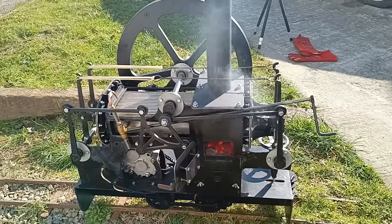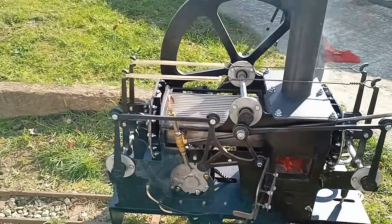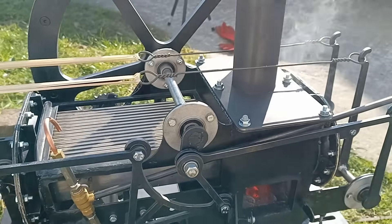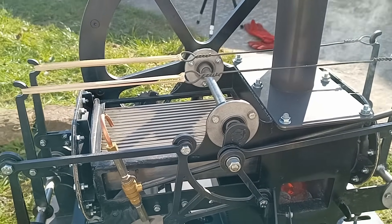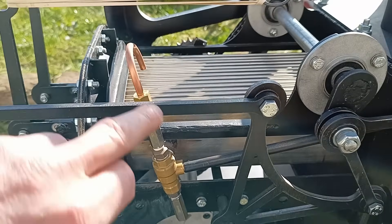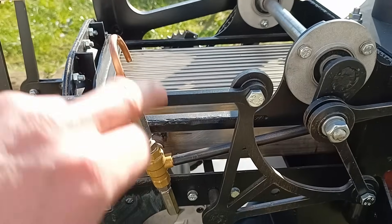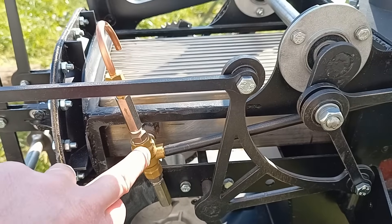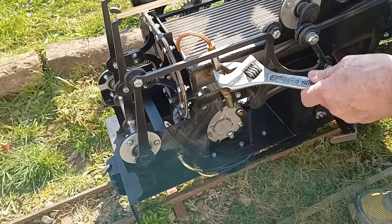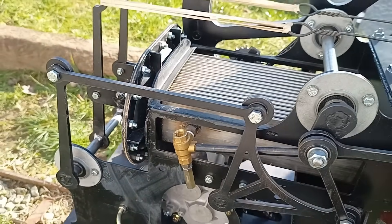Let's open that. Yeah, so it ran a little bit better than we imagined. We couldn't actually stop it though. The problem is there are slight air leaks within the engine that I haven't quite fixed yet. There is a valve here to let all the air out, but I think it's probably quite restricted with this little one-way valve over there. So what we're going to do is unbolt this a minute and take that out, and then see if we can actually stop the engine with the controls.